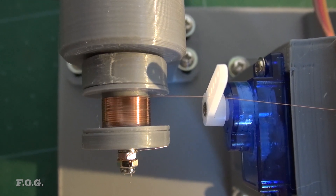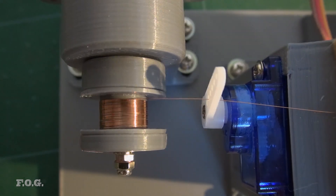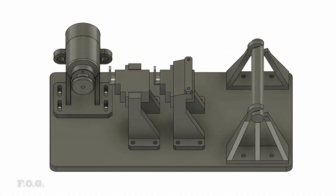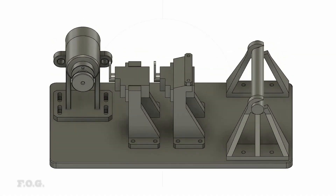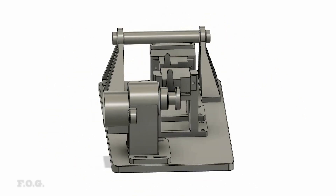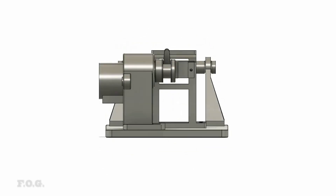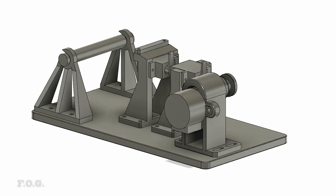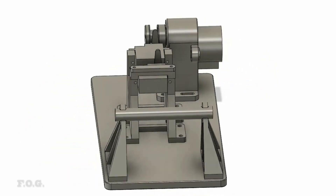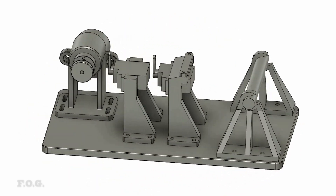After a little bit of thinking and a redesign, I came up with this. The updated design now adds a second servo. The first servo pretty much handles most of the feed wire's initial angular load, so the second servo should now be able to maintain a pretty accurate position for the wind. I also widened the base plate a bit so I can support some wider wire rolls that I have purchased. And finally, I modified the stepper motor mount so there's more adjustability and it can wind wider coils.